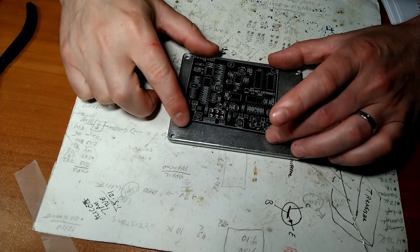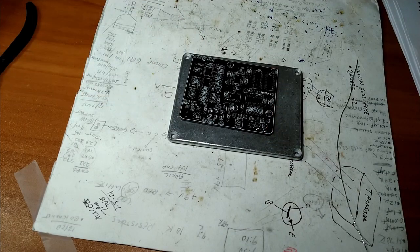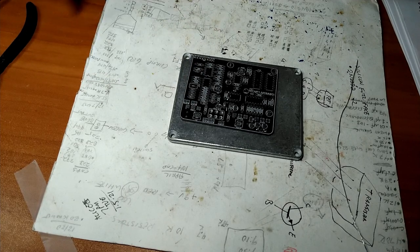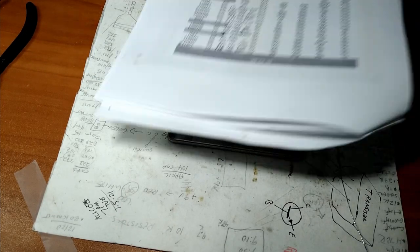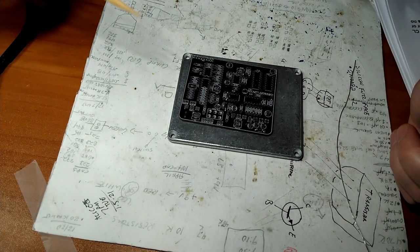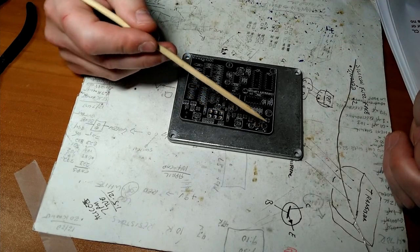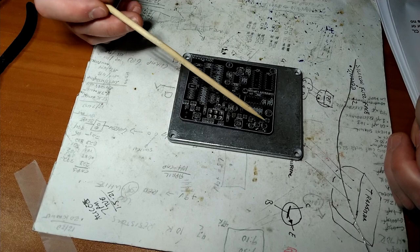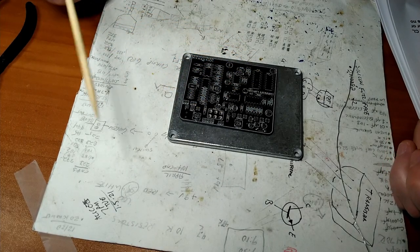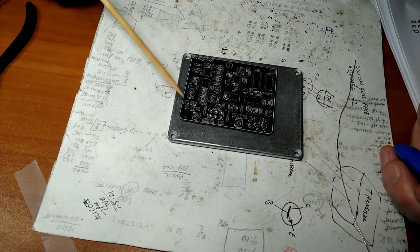There is 3/4 of the diode section done. D4, or diode 4, is an LED which stands higher than the resistor, so we'll come back to that one later. So number 2 and number 3 are done. Again, we were very careful to make sure that this was pointed in the right direction, lined up with the line on the diode, with the line on the circuit board. Just take your time and be very careful about how you do things. These things are a nightmare to troubleshoot if they don't work right. We like them to work right the first time.